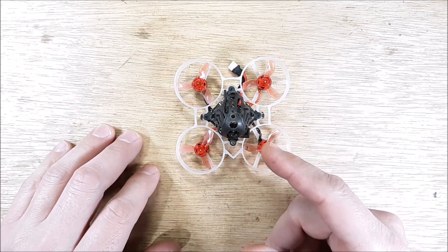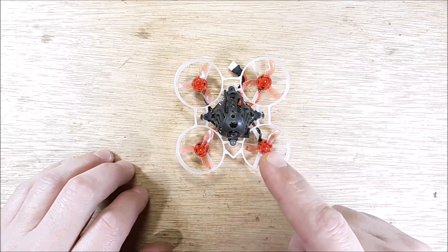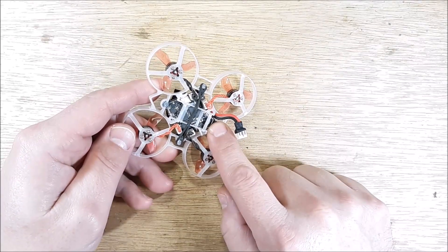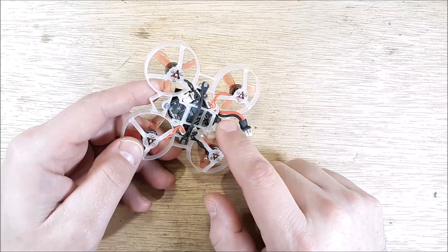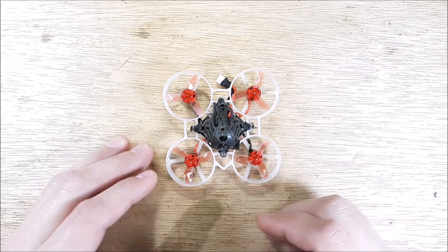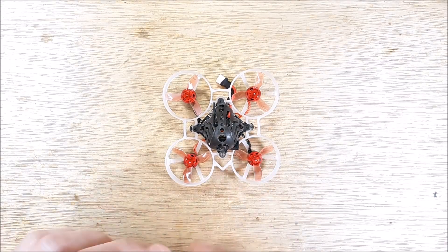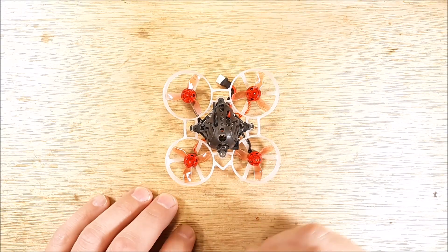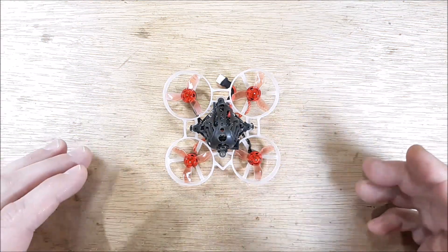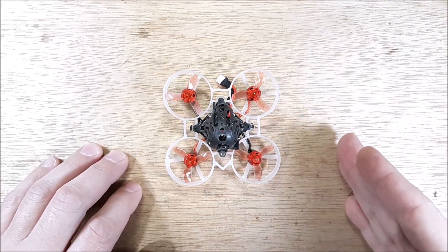So Happy Model, if you see this video, we've got to figure something out. If that happens to you, you're going to need your laptop or your Speedy Bee dongle. You're going to have to reload your dump file, or completely reset the thing from brand new. It's happened to me twice, to a guy I race with, and to a couple of my subscribers — so it's an obvious issue. I've been researching to see if there was a fix or updated firmware, and at this point there wasn't one.